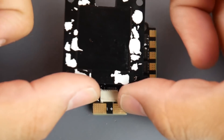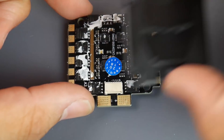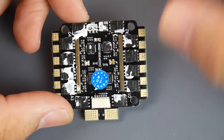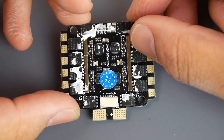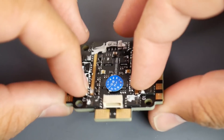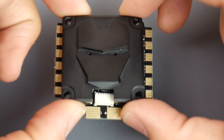Taking a look at the heat sink, we have these two little holes right in the middle of the two eyes — that's because we actually have two LEDs, so when this thing boots up it's going to have red eyes, which is pretty cool. On the board, I was expecting more filtration but there are no extra capacitors — just the FETs on both sides of the board. The MOSFETs are pretty big, I think these are the 3x5 or 3x4 size, so that's really nice.